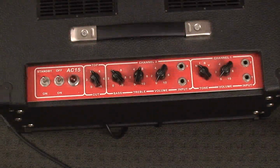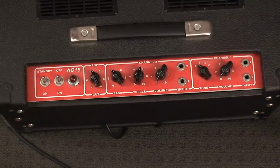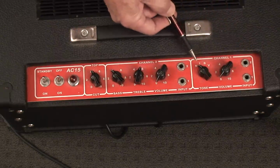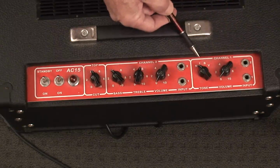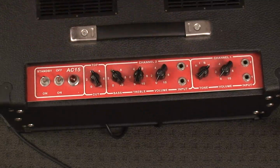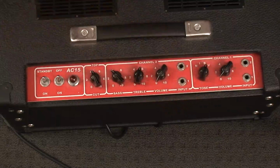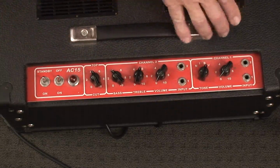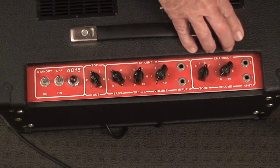So, Paul, this is your amplifier, which you made with your own 2 hands. Looks rather similar to something. Explain. Yes, well, it's a clone of an AC-15. But it incorporates 2 different channels. There is the normal AC-15 channel, which has got an EF86 preamp valve in it, but I've also got a switchable tone network, so you can either run it as a straight AC-15 or you can use it as it would sound for the vibrato or tremolo channel of an AC-15, which has extra bass cut, and I suspect they use that sometimes. You can also use it at the brilliant setting, which the 3rd model AC-15s had as an option. So this is the 3-in-1.